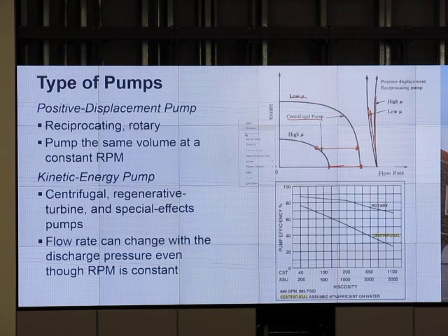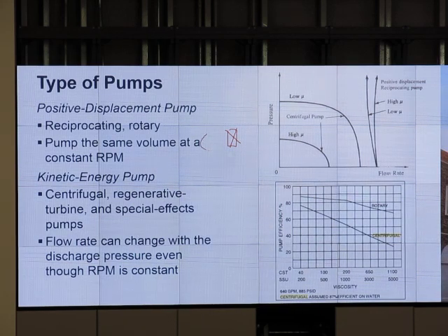How do I start a pump? For a centrifugal pump, close the outlet valve first, start the pump, then open the valve. It's preferable to start pumping against a dead end for a few seconds before opening. But for a PD pump, do not start it that way — if you close the outlet and turn it on, it will blow everything. For a PD pump, you must make sure the flow path is open and have a bypass or pressure relief switch.